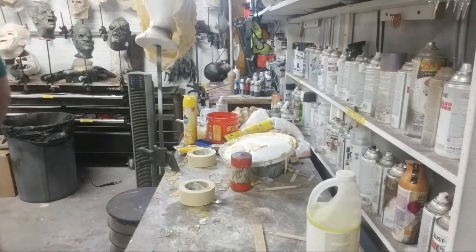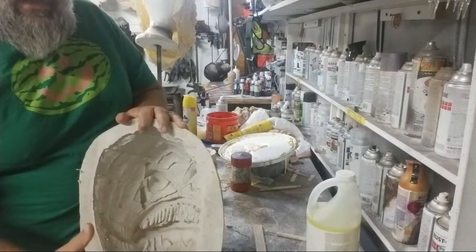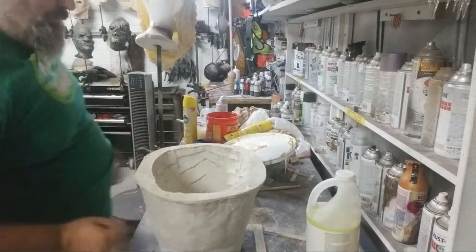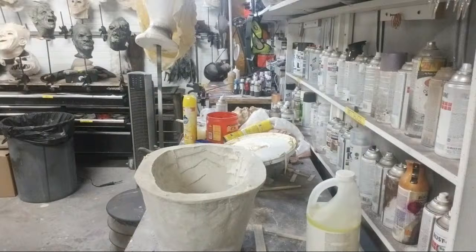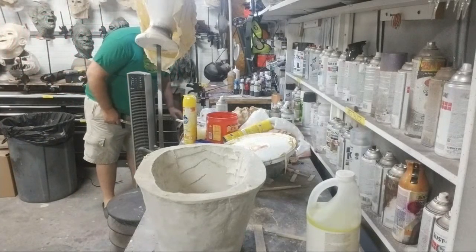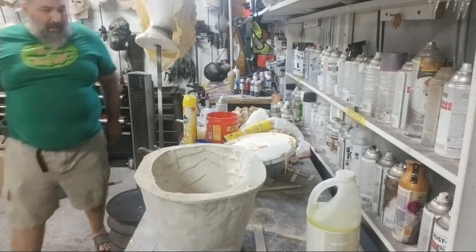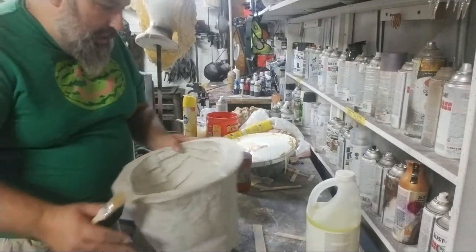Going to grab my mold, which is right here. Always use air and blow out your mold so nothing is in it, I should say. I'm grabbing a brush. So I'm going to do some brushing up. And I'm going to go ahead and grab a needle because I need to get in there and poke the teeth a little bit so that the air will move through there.